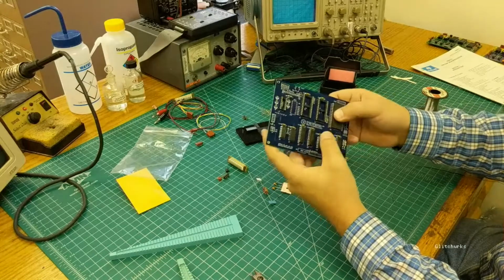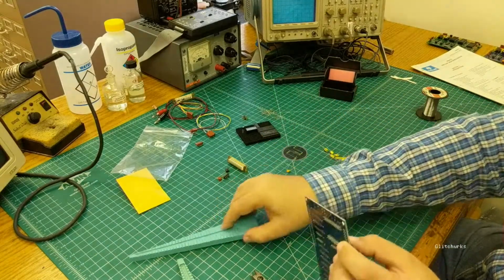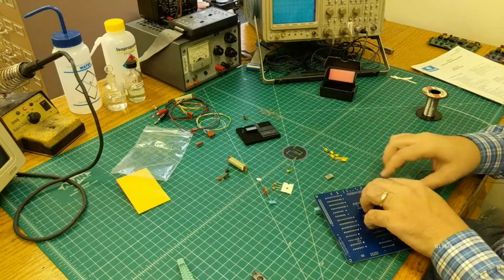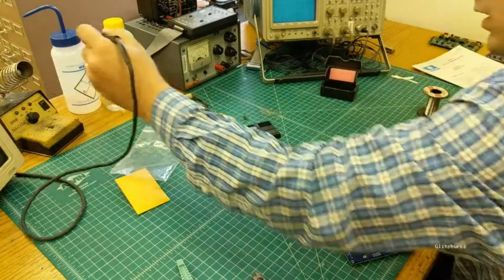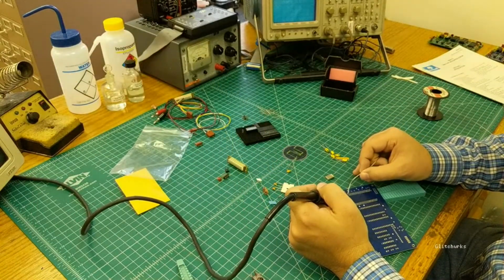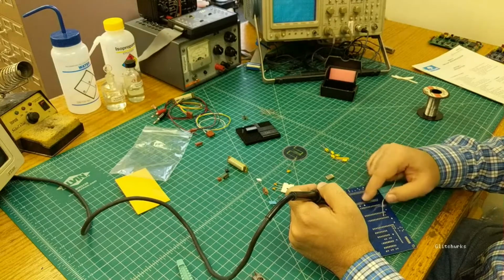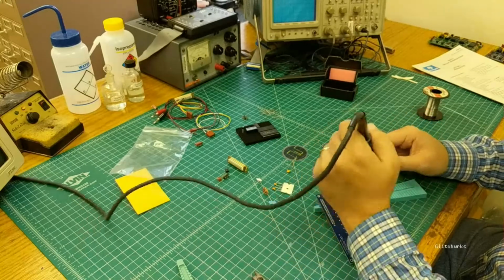So yeah, same as the others. Just make sure it's down tight. It's a little shorter than the other chips, so you might want to take something like resistor lead form or any old little thing, and just give it something to rest against there. And then again, just solder the corner pins. It doesn't matter which corners, I typically do pin 1 and the one opposite.